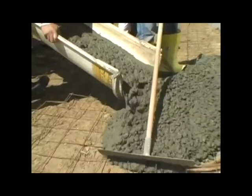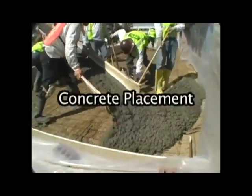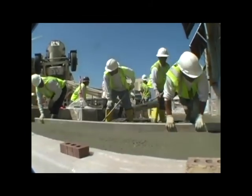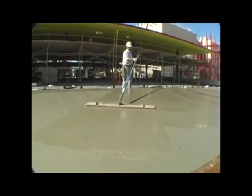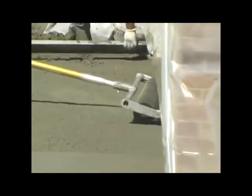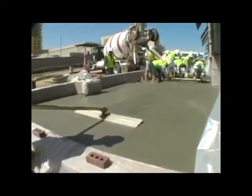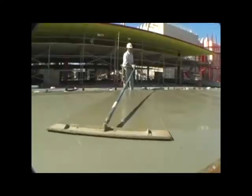Place concrete at a 5 inch to 6 inch slump. Screed the plastic concrete flat — this is very important for the micro finishes. Bull float with a wooden bull float both directions. For micro finishes, roller tamper or jitterbug both directions. Bull float both directions a second time. Wait until the bleed water has left before you do anything further.